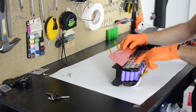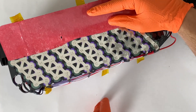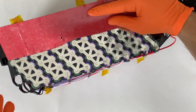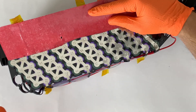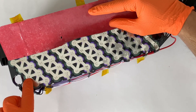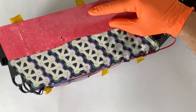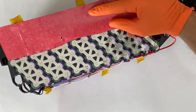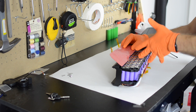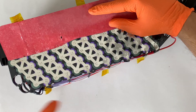Next, I see that we have four spot weld marks per cell, which means there were two instances of spot welding. It also shows me that this was done by hand, not by a CNC machine — I know that because the spot weld distances are not uniform. Here you can see they're close together, and here the two welds are further apart. So this was done by a human, which is totally fine — doesn't mean it's bad. I would have preferred a machine because then you know each weld is at the same load and same procedure every time, but these can be just fine when done by hand.